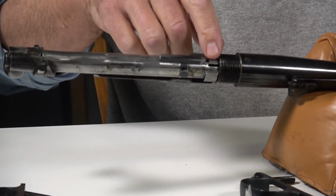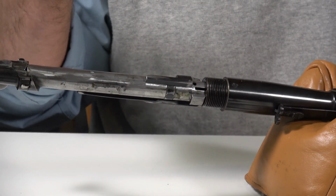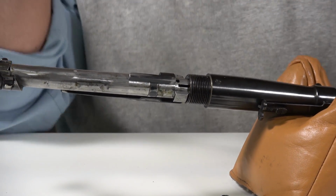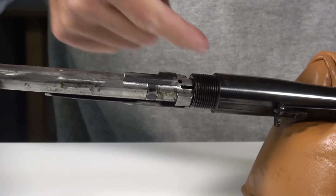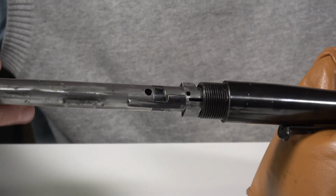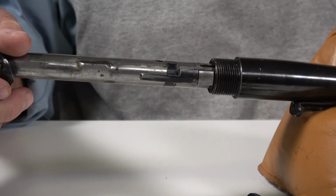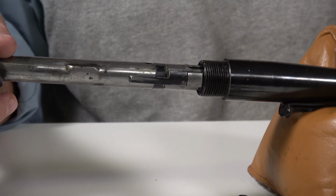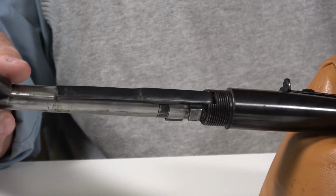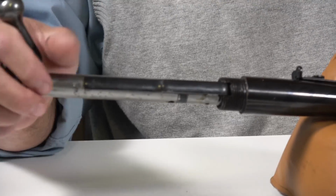right there, and that is where the blade ejector, which is integral with the receiver, I don't think it's a separate part, hits the case when you pull the bolt back, and then the empty casing or the loaded cartridge is thrown out. I hope that is understandable, and if I'm not saying the right words, at least you can see it working in the gun. And because of this claw, like the Mauser 98, there are no mistakes.